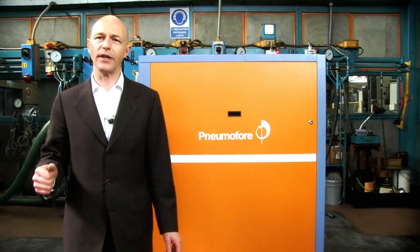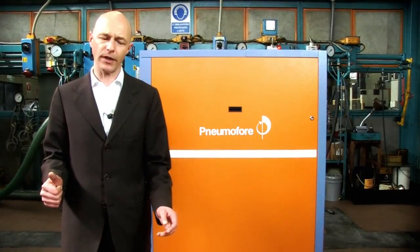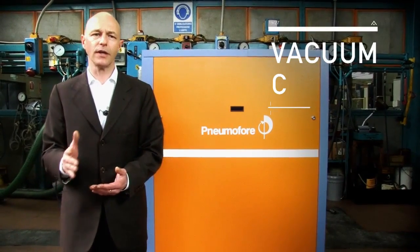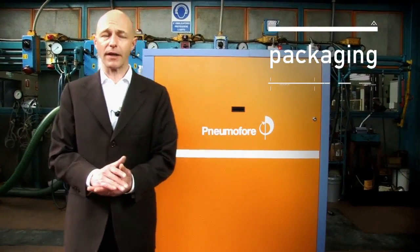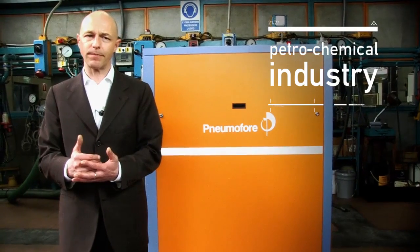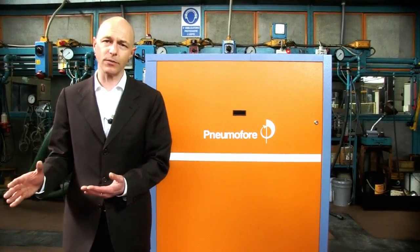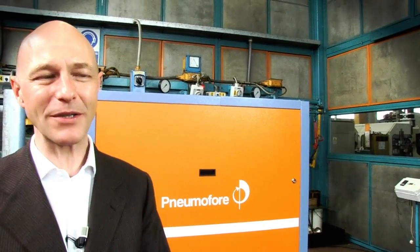This special feature of the UV8H vacuum pump cannot be found in competing technologies. Customers are found in the food industry, both for the processing and the packaging of food — we talk about degassing in pasta factories, different extruders, freeze drying, vacuum cooling, bottling, cheese packaging, and sliced meat packaging. The evacuation of water is also found in the chemical industry where polymers or granulate must be completely dry, and in the petrochemical industry where long intercontinental and transatlantic pipelines need to be evacuated so they are completely dry and ready for the gas-up process.